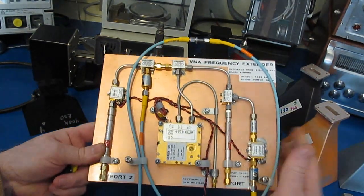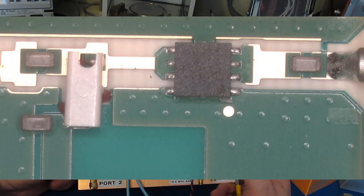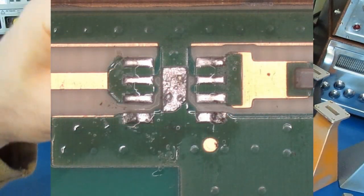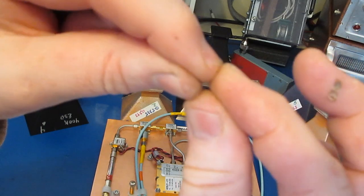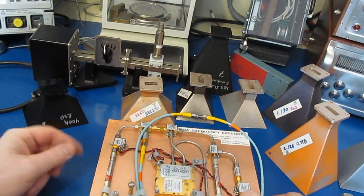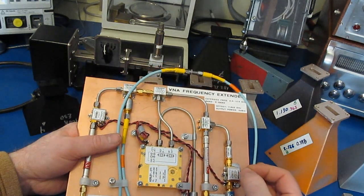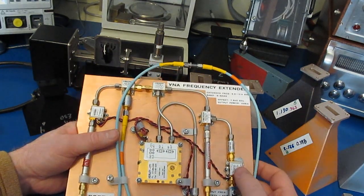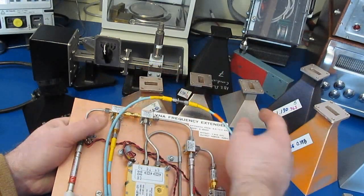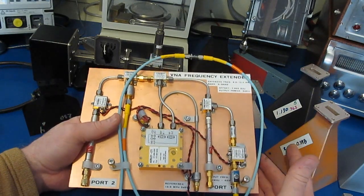And what ended up happening, we damaged this amplifier here. Now I could buy the op amp that this uses. It cost about $25 a pop. Now the IC that's used in that amplifier is about this big here, and it's an 8-pin device. So I'm actually grinding down the soldering iron tip to get something small enough to lay in there to reflow the solder around that after I hit it with a heat gun. So I was able to repair the amplifier, and I went back and I baselined some of these antennas just to make sure that we didn't hurt the performance at all.